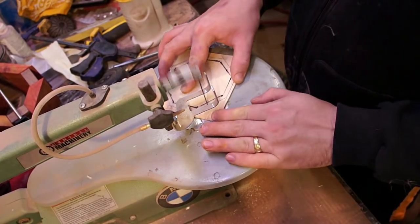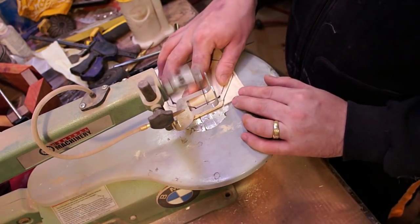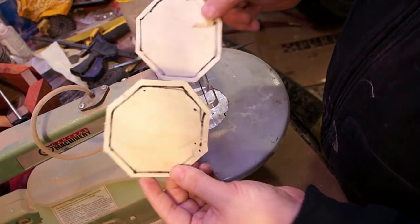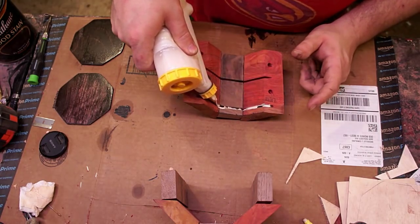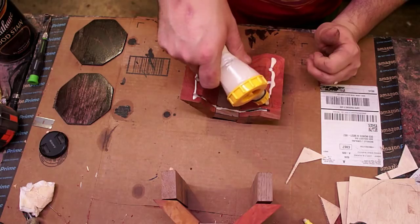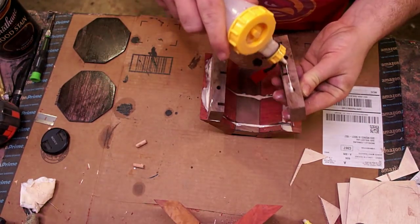I'm using the scroll saw for this — I tend to use my scroll saw more for mini band saw work than for actual scroll sawing, so I changed to a little bit thicker blade to get more straight, accurate cuts. This video was already getting a little bit long so I stained those bottom pieces off camera with off-the-shelf stain you get at the hardware store. And then we are now ready for the final glue-up.